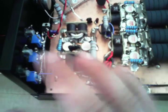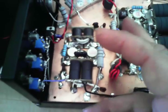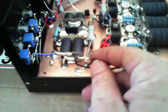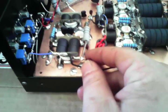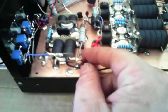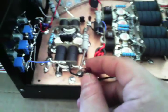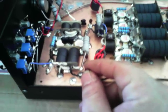We kind of like to have a resistor there, man. It kind of helps slow that RF down just a little bit so it ain't just jammed into the four-pill section. I'm glad I did that because I'm glad you asked me to do this, brother. Because this is something that's just been sitting in my closet that I had bought from a buddy named Triple Nine. I hadn't done nothing to it except put these feedback circuits on because he had took them off. This right here wasn't even hardly soldered well — I just moved it and it came off.